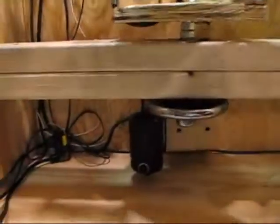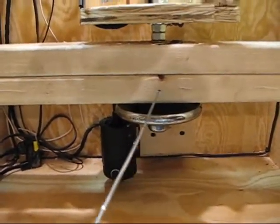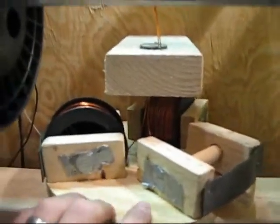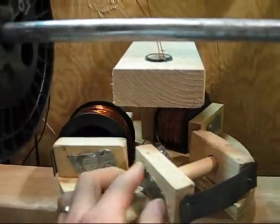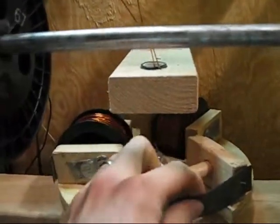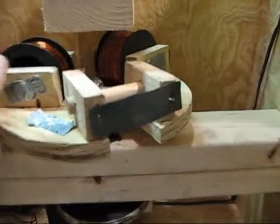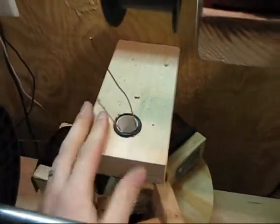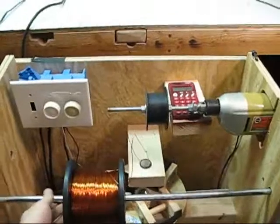The second motor is from an old sewing machine. It comes onto a piece of all thread — that's my shaft coming up here. I've got a piece of plywood mounted onto there, which three spools can fit onto. It's just a dowel rod coming through the center of the spool — you can take those out. There's a piece of rubber on the back which comes into contact with the spool to keep tension on it, otherwise it'll just completely unwind on you. That comes up through this 2x4 here, which has a piece of PVC through it to keep it straight. And there's this bar here which holds your main spool of wire — just a bar coming through there.